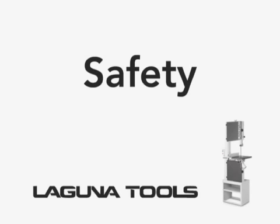Now we can plug the saw back in. Make sure that you do not have any loose clothing. If you have long sleeves, roll them up. If you have on any jewelry or watches, remove those at this time. Put on your eye and ear protection. You will need to have adequate dust collection and a respirator.